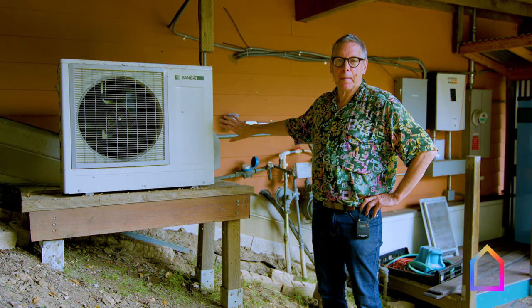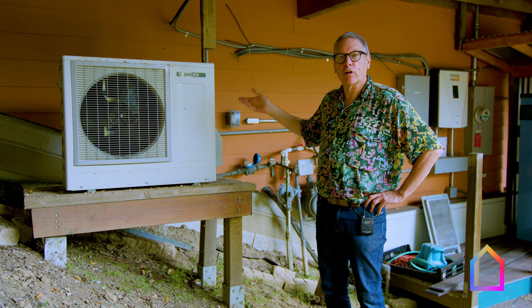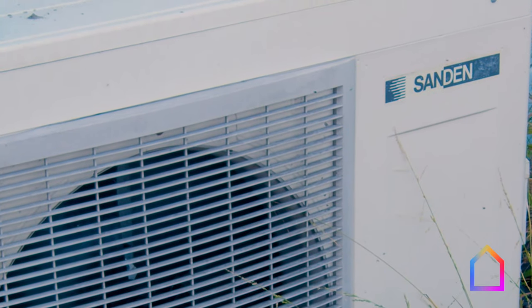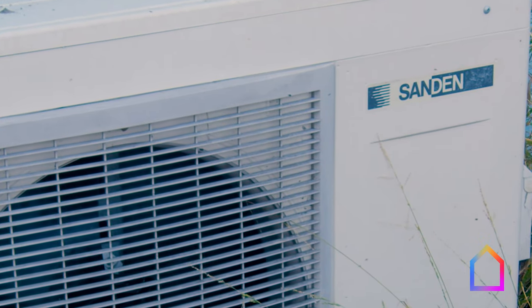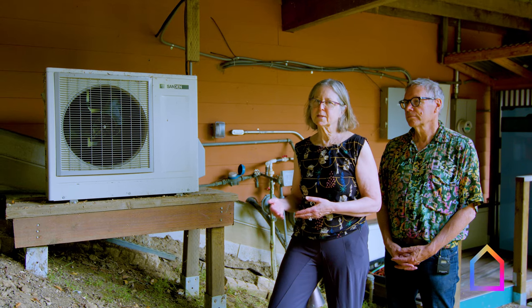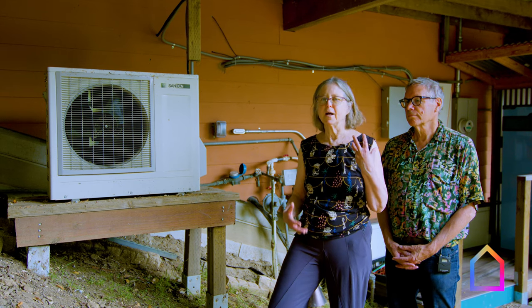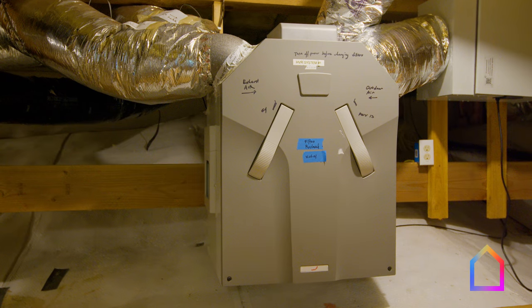This is our hot water heat pump. It supplies domestic hot water and also hot water for our space heating. It uses CO2 as the refrigerant, which has a low global warming potential. We have a sensor that figures out how much hot water we used the previous day and makes sure we have that much and more in our storage tanks. During the winter, we just set the thermostat at 70°F and forget about it — I've never been able to do that before because I was always conscious of energy use. It's been transformative in terms of comfort.